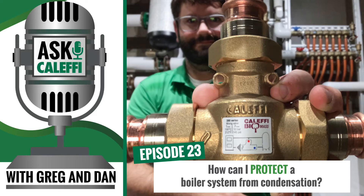The 281 is going to work in a similar operation. We get a lot of questions about piping these and pump locations. Pump location is big with these — it's got to be on the return, pulling water, pushing water back into the boiler, pulling water through the valve. We have a nice diagram in the install manual showing the operation, but you've got to have the pump pulling through the mixing valve.